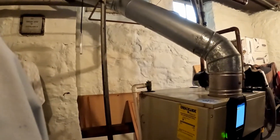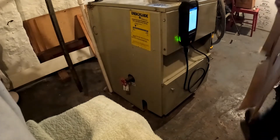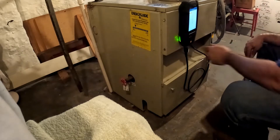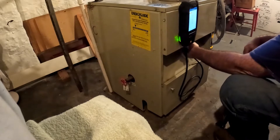Can you shut your door? I want you to shut the screen door and close that door - we're not getting any draft. I got to test this to make sure we're getting the right readings. Right now you've got 1,600 parts per million of carbon monoxide. So what I'm going to do is not do the draft test - you have no oxygen. You can see there's no oxygen here.